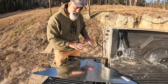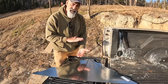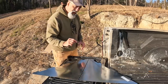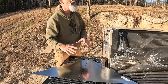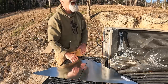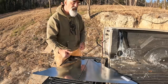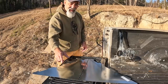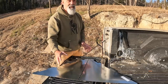The whole point of a snow splitter is to prevent any load of snow sliding down the roof from pushing into the chimney. That much snow, if it starts to move, can rip the chimney right off the roof. Last year we had ice — only about that thick — but as it came down the roof it pushed on the thimble around the chimney and dented it. I did a temporary repair, straightened the collar and siliconed it back on, but now I have a new collar and this setup to fix it properly.